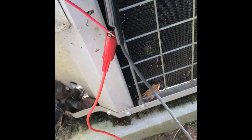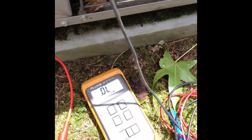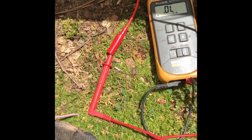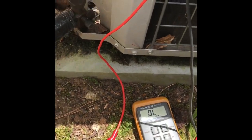I'm going to switch it out and run it for a while. I've got the new defrost thermostat hooked up and I'm just jumping it out to test it. I'll run it for about 10 minutes like this to make sure it's not going to close, because the old one was actually closing in the AC mode — it's supposed to close at 30 degrees, not 65 degrees. That coil doesn't get that cold in AC mode.